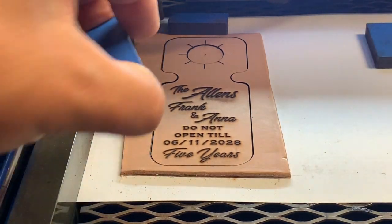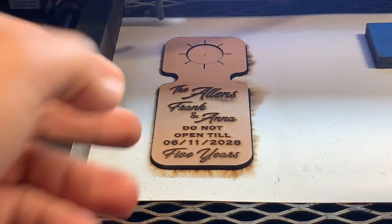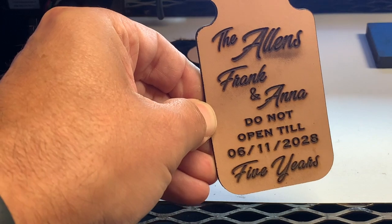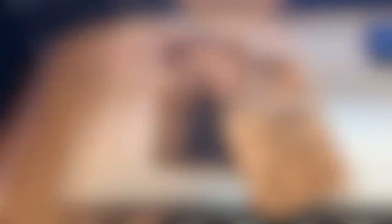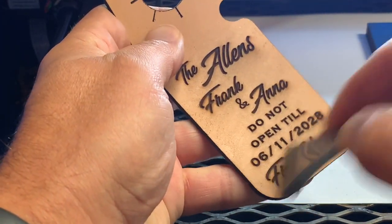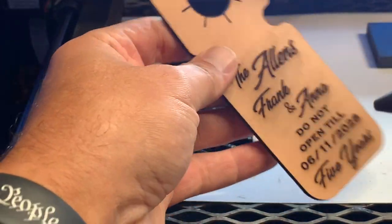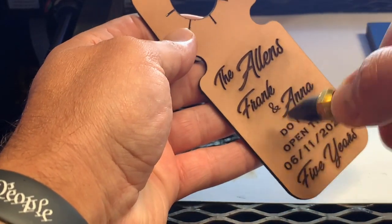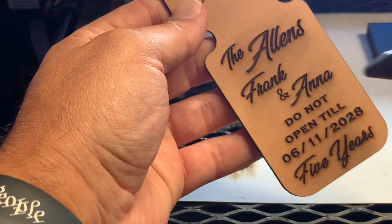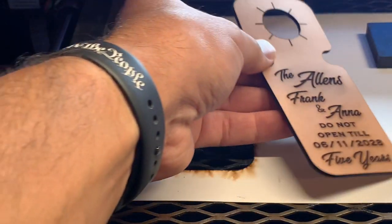Now that it's cut out — I use magnets to hold things down in the K40, which is definitely helpful. After cutting leather, especially with engraving, I like to get a small hard bristle brush — sometimes a toothbrush works. I brush out the letters because you'll get a little bit of charring in them, and this helps remove that, especially if you're going to use leather dyes and finish the leather. After brushing, I come back with a little compressed air for a final cleaning so there's no dust or dirt inside. Then we're ready to apply the dye and finish the leather.